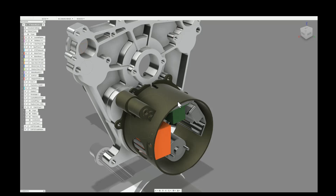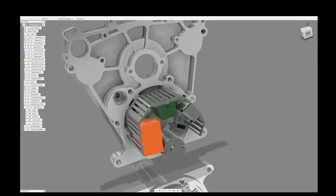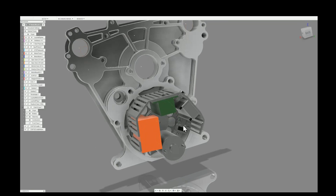I've also started working on how I'm going to fit all these electronics into the clutch slave housing. I've come up with this slotted cradle design that has some modular mounts so I can mount the individual components. As you can see, I've got the electronic speed controller right here, this represents the stepper motor drivers, this little cradle is for the ESP32, there's a space for the buck converter, and I've actually integrated the photo sensors down here so the slotted wheel can measure RPM on the lay shaft.